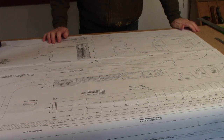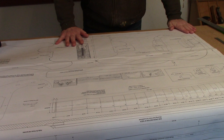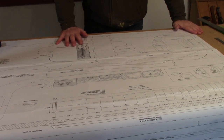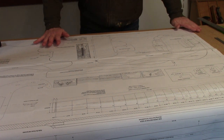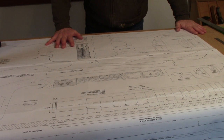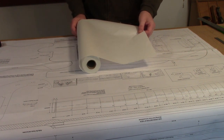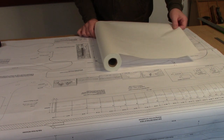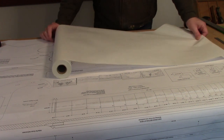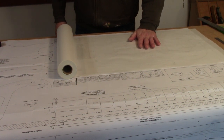There will be a couple of minor twists along the way that we'll discuss when we get to them. The first part of any build is generally making a set of templates. Ordinarily I'd buy two sets of a plan and cut one up to use as the basis for making templates. This time I'm going to do something slightly different — not just because it's cheaper, but also because cutting a set of plans up is a little bit wasteful. So I've bought a big long roll of white tracing paper — there's 50 metres on this roll, enough to do multiple guitar builds — and I'm going to use it to make tracings of the elements of the plan that I need.